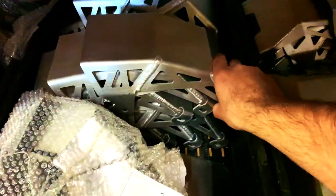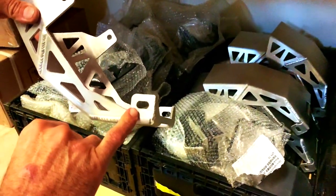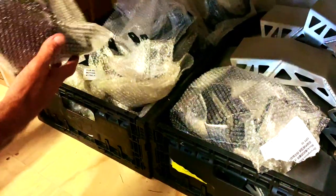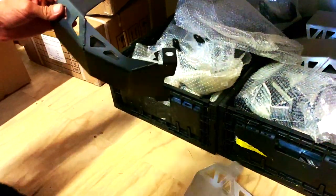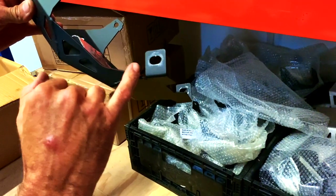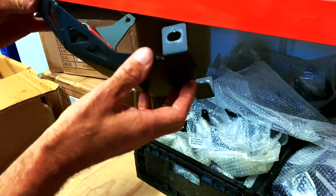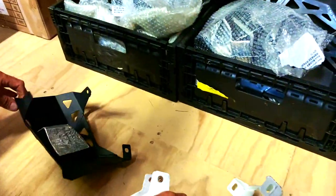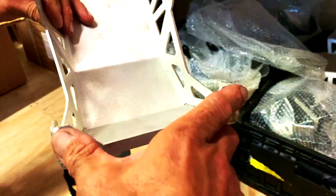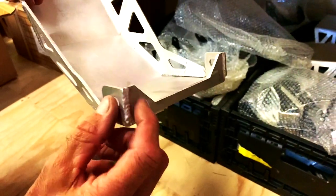And it's got the reinforcement here, right? Yeah, well designed this one. This one's got the extra bracing down here on the bottom leg. So why do people normally bend this thing? These ones seem to cave in because there's no strength attaching this point to where the fixing is. So this stays strong, but this cops all the beating. We tried to make this one stronger, so we've gusseted a brace to here. We've also given it a return on the back, so it keeps it a lot stronger across here and reinforced off the mount as well.